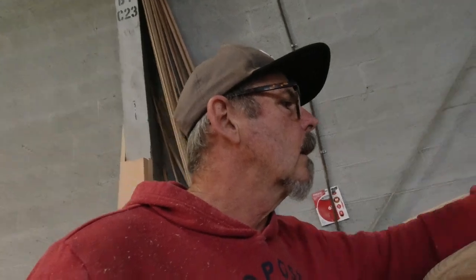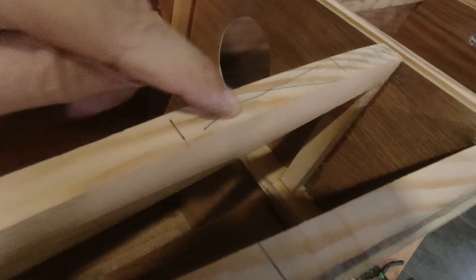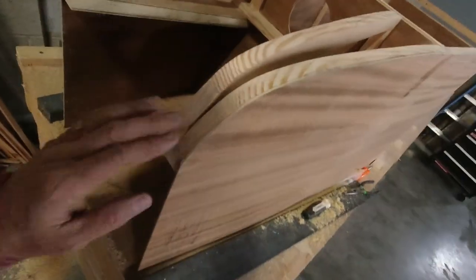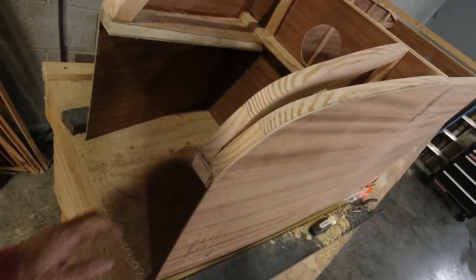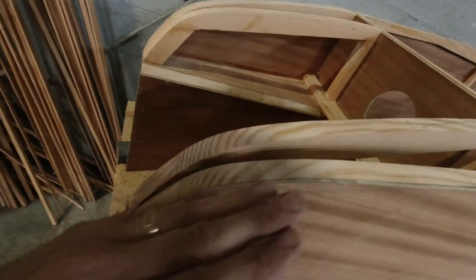All right, so my plan here is to lightly work this with my belt sander, and I'll keep making little marks with my pen, and then I'll work those marks out. Then I'll go from there, and probably take my pencil and make some pencil marks. Either one. On the outside I'll do the same. The outside is higher because of the angle, so all I have to do is fair this in with this, take some of this off without messing with this, and we should be good.